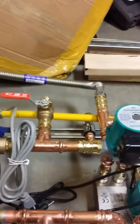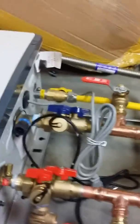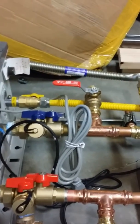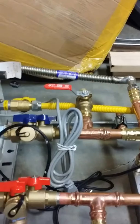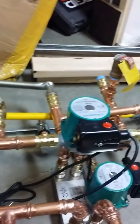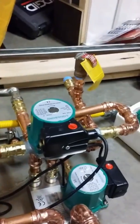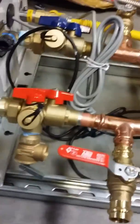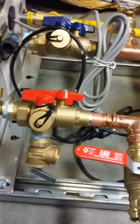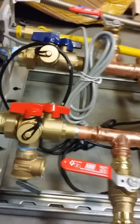On the connections on the far side we have ports already ready for the gas. We've got two ports with stainless steel flex lines for your expansion tanks, a 30-pound pressure relief valve on the bottom side, and right over here we have the 150-pound pressure relief for your domestic hot water.